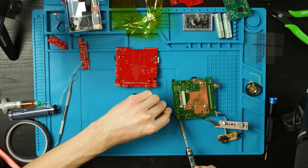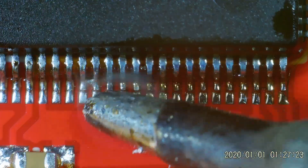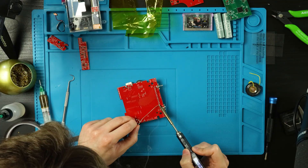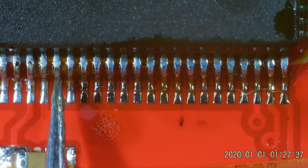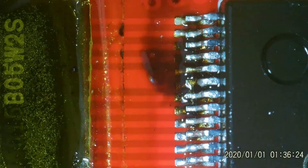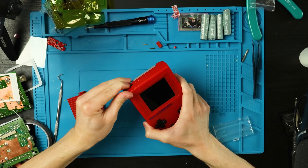Assuming you have your board as pre-assembled as mine, start by removing all of the components I mentioned earlier from your donor GBC and DMG. I like to use hot air, a solder sucker, my soldering iron, and a ton of flux to do this. From there we can just install all of those pieces on our new boards. I like to start with soldering on the CPU and crystal with hot air, and then checking all the pins under the microscope. I ended up struggling with this section — even after all the work I did in this corner, I still didn't have them all fully soldered down, which caused my screen to look glitched and it wouldn't read my games.